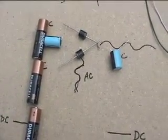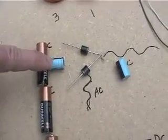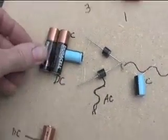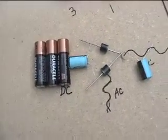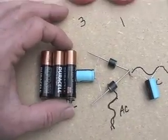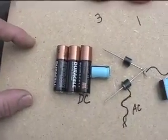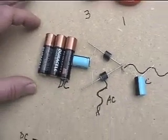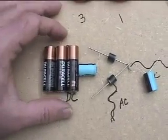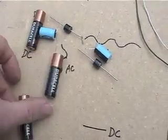Whatever your wind turbine, hydro system, or steam engine is driving this alternator, however hard it does, it's going to create some voltage — so it might be 10 volts or 15 volts out of here. Now if you don't want to do a voltage tripler, you can put them in parallel and it'll give you more amperage but at a lower voltage. So let's say this is still creating 1.5 volts — put them in parallel and we're going to come off with our positives and negatives at a much higher amperage. Same watts coming out, just different voltage. So if you want to charge a 12-volt battery bank, you may want to use a parallel system. If you're trying to charge a 24-volt bank, you may want to go series.